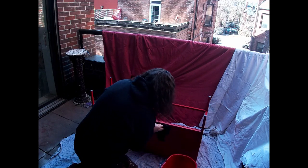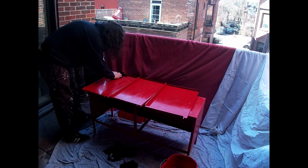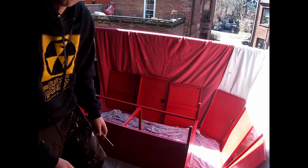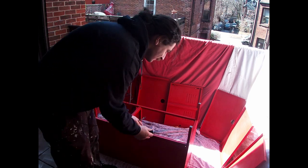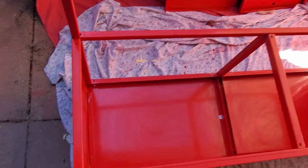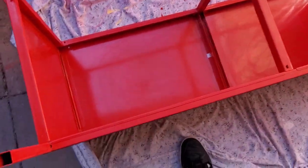I do have a bunch of rags and a bucket of water and I'm gonna wipe everything down again, get it nice and clean, and then leave it out to dry. Hopefully by then the sun will be hitting here and we'll have a warm enough day to get spraying. Alright, the sun's coming out and everything's pretty well dry, so I'm just gonna take this dry cloth and wipe off the rest of the dust and water. I'm also gonna see if we can pry the feet out so they don't get painted. We'll start with the bottom and the inside, then flip it and do the top — and you don't want to be too close; you want to start spraying while you're in motion and just keep going.